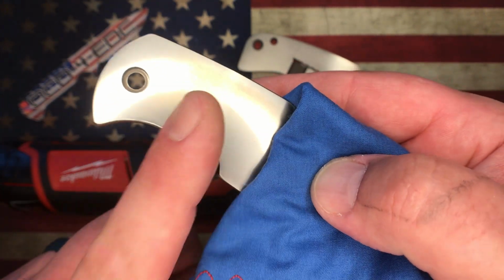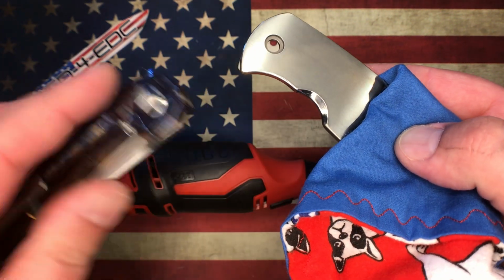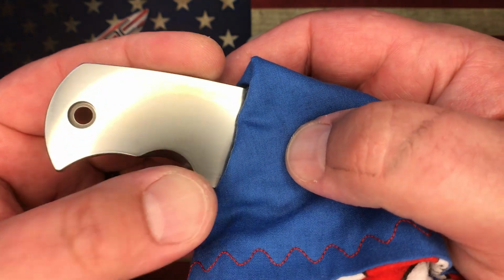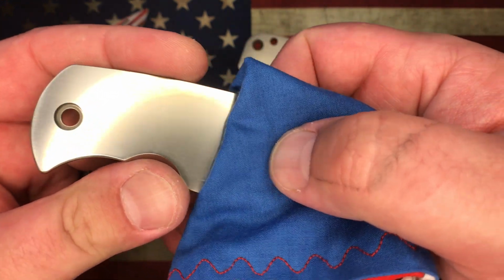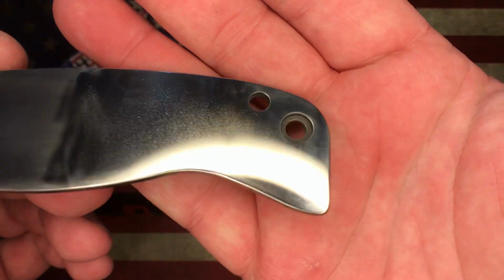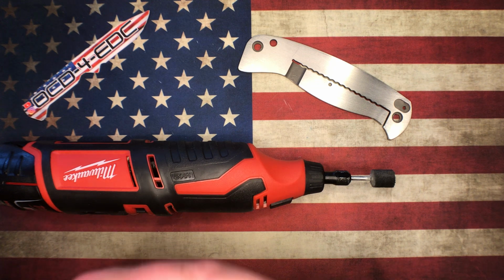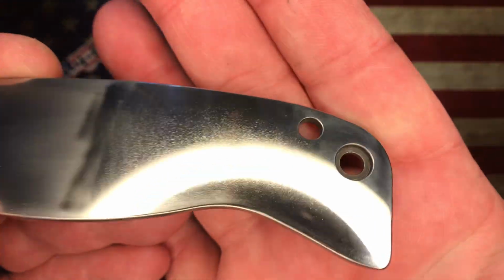This is not good enough if you want a perfect mirror finish and for the colors to really pop. So I'm going to show you the difference, because I did half of this, the difference between not enough polish, or sanding to about 2000 grit, and actual polish. So this is actual polishing. Now, the reason I'm showing this is because this isn't actually done, because I actually have to go back to the sandpaper because I did not do enough.